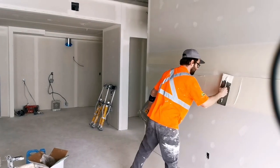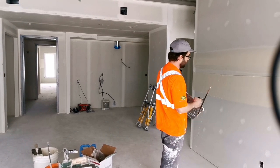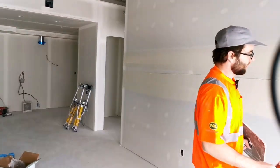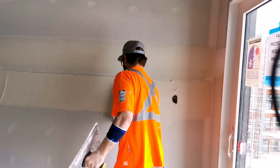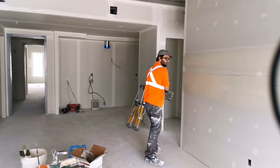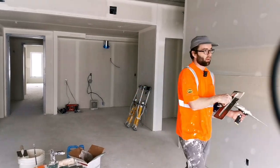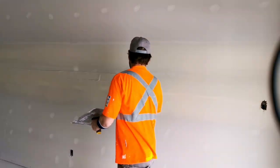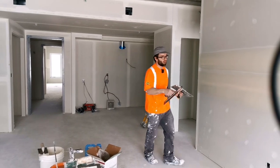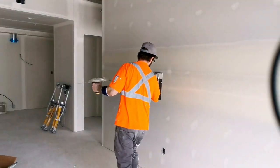I lay on a little extra and because it is kind of like a butt joint I don't want to overload it too much. I'm mostly just aiming to get mud down the sides. My plan here is I'm going to do this first and then the next day I will coat the whole thing as one joint, and I might even put another coat over top of that. It is a lot of extra work when walls are boarded this way — lucky me, I get to fix it up.